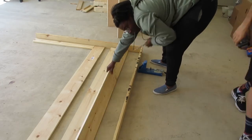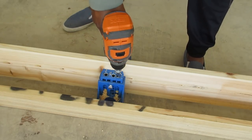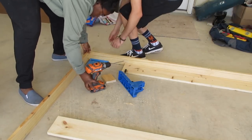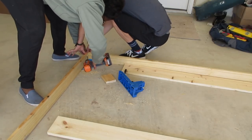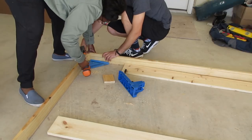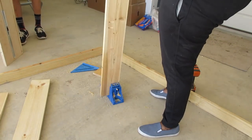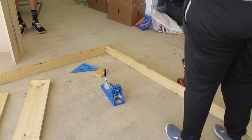So I'm going to take my first board and drill pocket holes in it. I'm going to do two sets of three, making sure on the top I am drilling all the way through and getting a good pocket hole to connect to my top piece. Now I have my two pieces on the ends - the 2x1s. I'm going to make sure they're square and ready to go. I've already drilled pocket holes on the ends and I'm going to put my screws into those pocket holes to connect. You'll see that I'm putting it in the corner and drilling into the top. Now that I have my top done for one side, I'm going to drill pocket holes on the sides of the first plank to make sure I can connect it to the side and top pieces that are 2x1s. This will help me when I'm ready to actually connect everything.